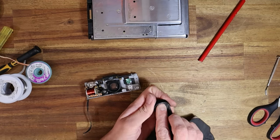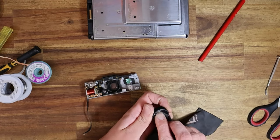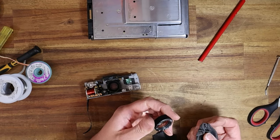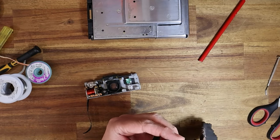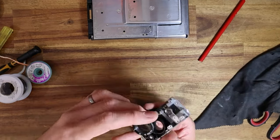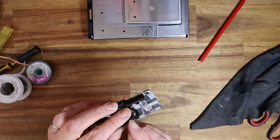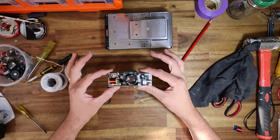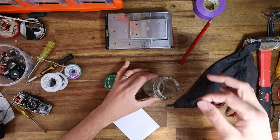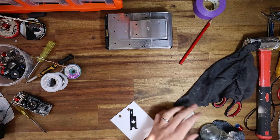Even the front cell is coming along really nicely. There does appear to be just the tiniest bit of damage toward the very edges of the lens cell, but I think that's most likely due to oxidization of the coating as opposed to any damage from the fungus. There's a little bit of oxidization to the coating just on this one surface on the rear of the front helicoid. We are back together. What I'll probably do now is redo the shutter blades — make sure I get all the acetone off them — and then we can put the shutter back together and give it a test.